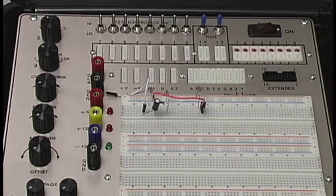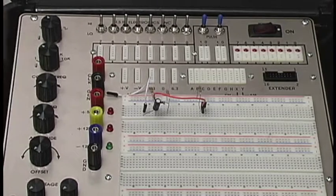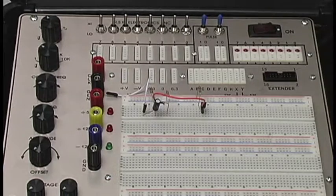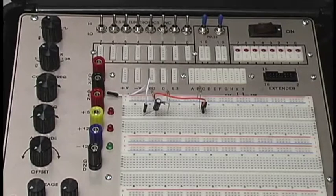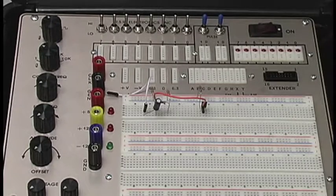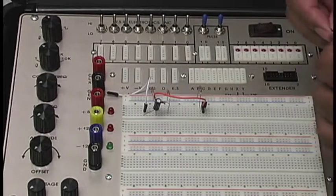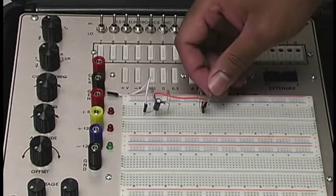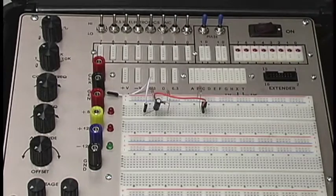And now here what I'll do is I'll take our 1.5 kilo ohm resistor. Okay, so what happens is that we don't actually necessarily have a 1.5K resistor. So if you remember from our series and parallel video, we actually have two 3K ohm resistors in parallel with each other to give us a 1.5K resistance in total. Okay, that's going to work here. Going from our negative.